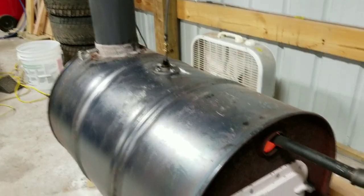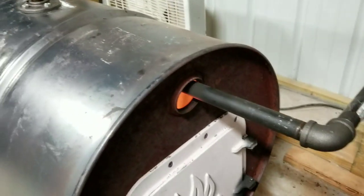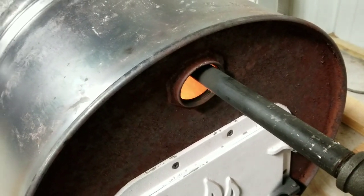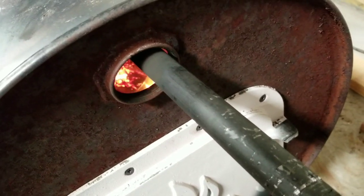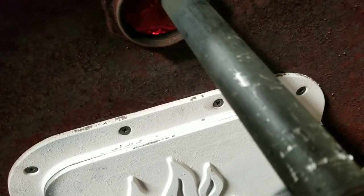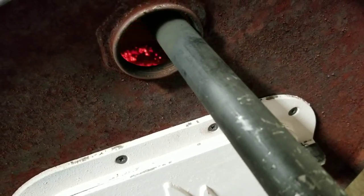Air's on — just turned it on and closed my door, and you can hear it really blazing inside there. It's going strong. What I usually do is let it kind of burn down some of the oil in the pan before I open my faucet valve back up, because there's usually so much oil in there it'll start spraying out and going everywhere. You'll have flames shooting out of any hole on your stove if you don't burn some of it off. So basically you can see I've got it down to just barely going, and when it starts dripping again she'll flame back up. The goal is to get the pan hot and keep it hot enough to keep the oil burning.